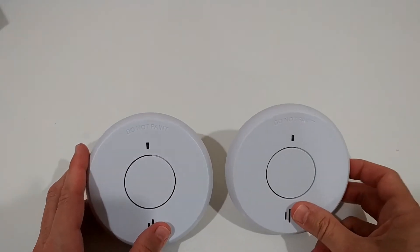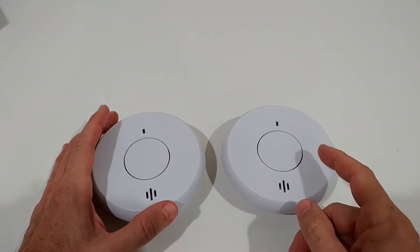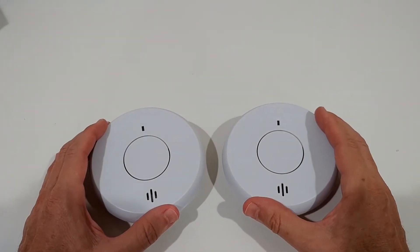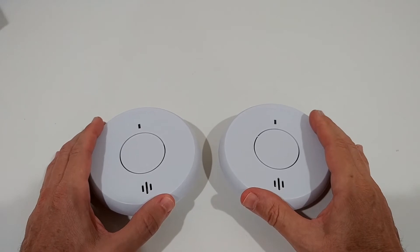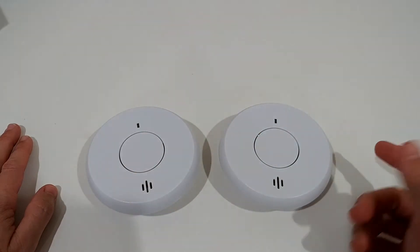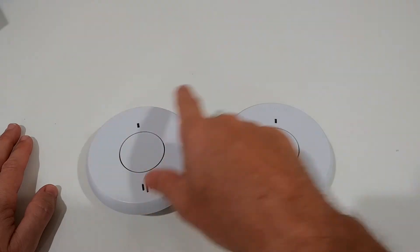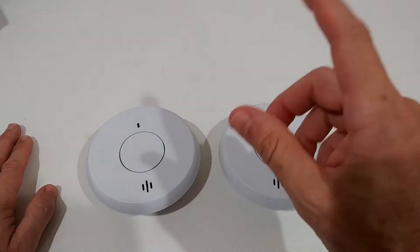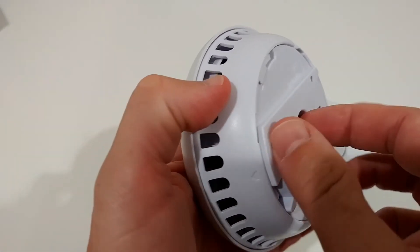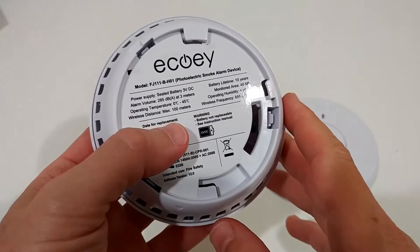Looks like this is very easy. I've been watching these smoke alarms for a bit — it looks like they are independently flashing maybe every 45 seconds or so, indicating they still have enough battery. To test, we can push one of them for a couple of seconds and it should activate the alarm. All of them should blink twice per second with a red LED. The instruction says it emits an 85 decibel alarm.